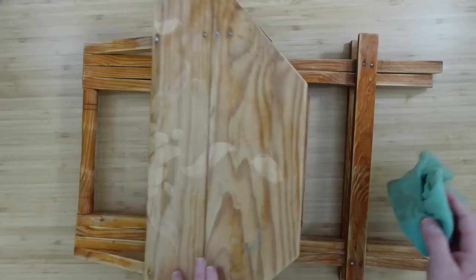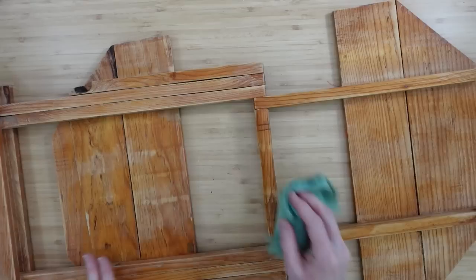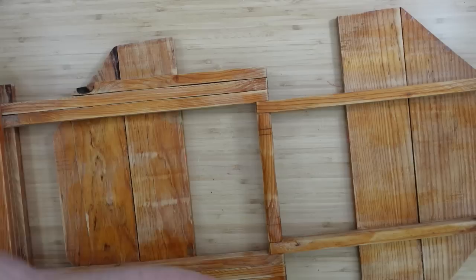All sanded — now I've got it on my table. You can use a sticky cloth to get off all your dust, or just use a dry towel or a damp towel. I like to use a slightly damp microfiber cloth to get all of the dust, shavings, and paint particles off. We're going to start with a very nice clean surface because on the top, we're going to be painting it and I don't want anything to muddy up that paint.